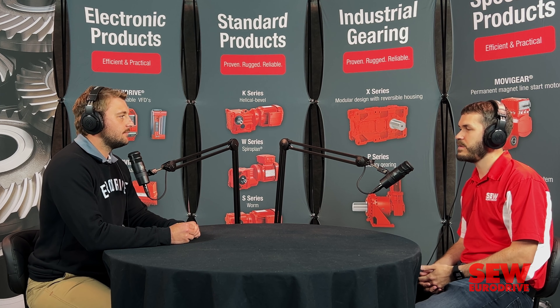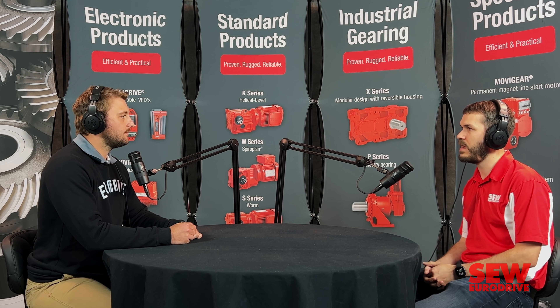How is the X-Series an improvement upon our previous MC-Series? It has a lot of the same capabilities as the MC-Series, but the MC-Series stopped at a size nine, so there's only eight sizes of MC-Series. The X-Series really covers just the small version, but we also have X-Medium and X-Large, which goes — X-Medium up to a size 250, X-Large up to a size 320. So we've added quite a few sizes, which can cover a lot higher torque range, getting into three, four, five million inch-pound type scenarios.